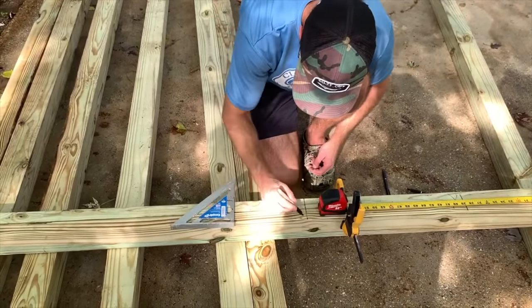Okay, so we have our wall preliminarily framed out here. As you can see, we have all of our marks. I'm gonna go to the other side because I think it's a little bit clearer. We have our mark there, our mark there, our mark there. And again, we have these wall studs marked in accordance with the course guide. And then what we're gonna do is take our nail gun and nail two nails into each wall stud through the top and bottom plate as you're seeing.